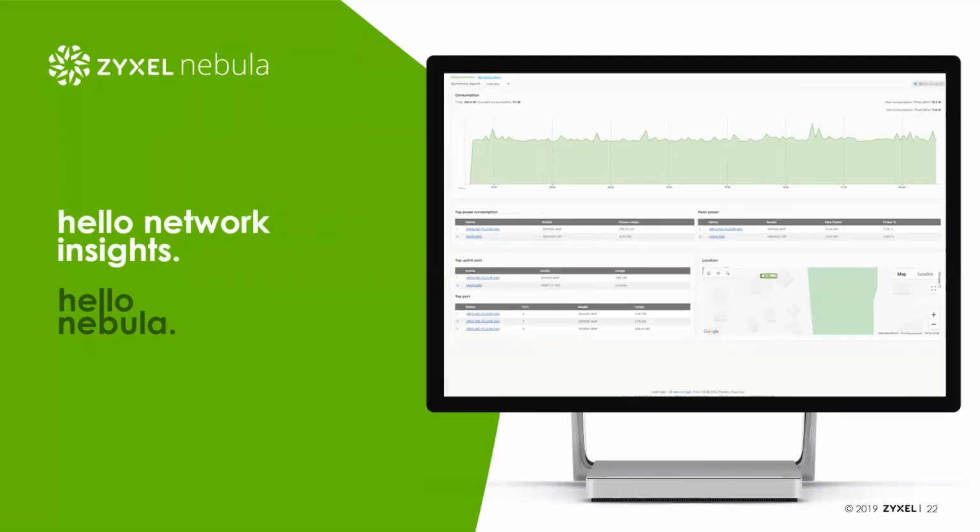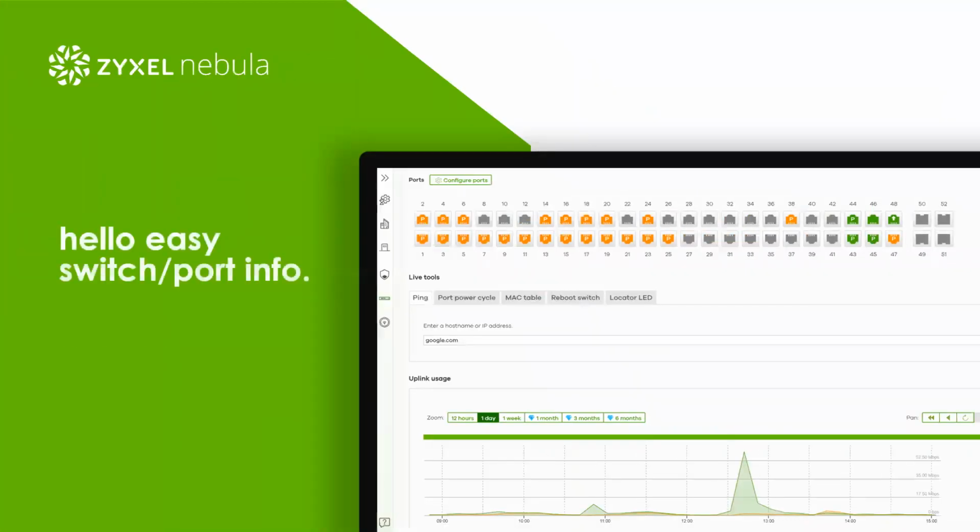Some additional network insights as to what's going on your wired network. Going in to manage your switches, as you can see there, you've got your ports visually represented. You can easily go through, select multiple ports. You can do some basic live testing, such as pings, power recycling devices, MAC tables, as well as bandwidth utilization charts over time.